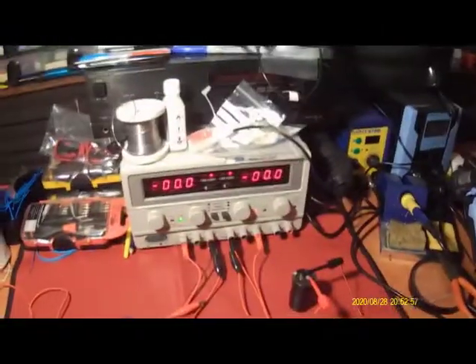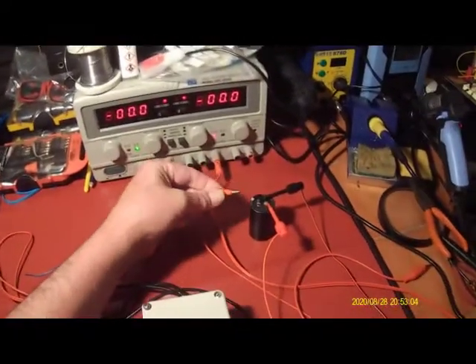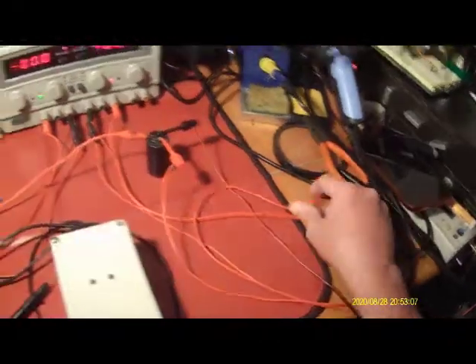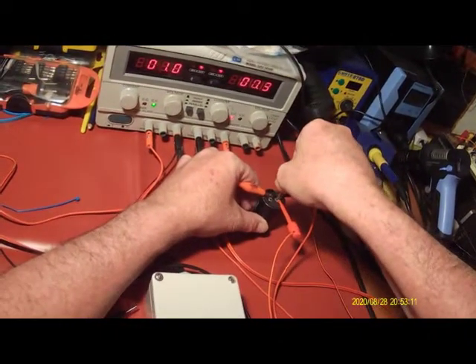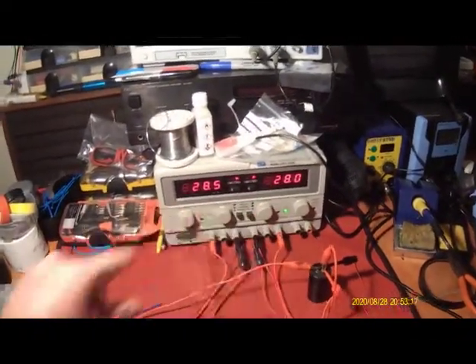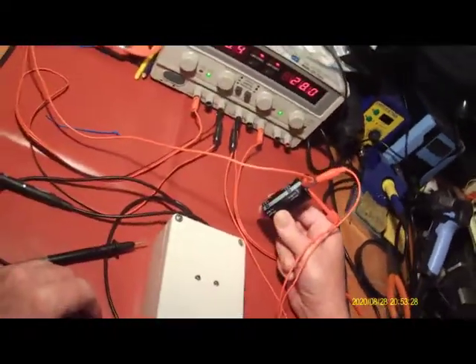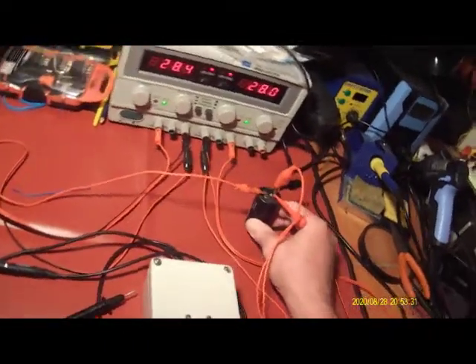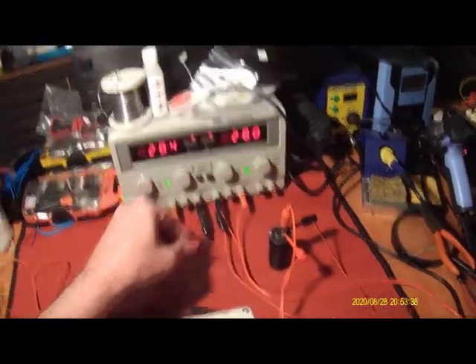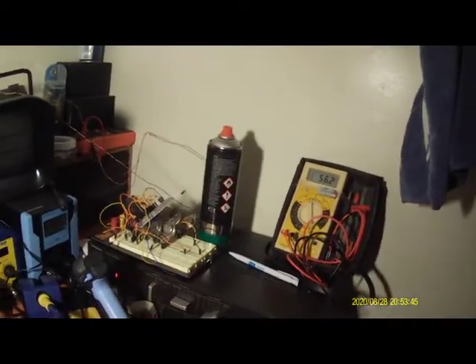You can see I've only just got 3 volts on it. Double-checking that's the negative and positive — just gives an idea. Whacking that straight up to 28 volts each side, so 56 volts across the 56 volt cap. This one is a 6800 microfarad, so it's very large for an audio amp. So that's charged — take that off, turn that off — and you can see now it's still charged to 56.2 volts.